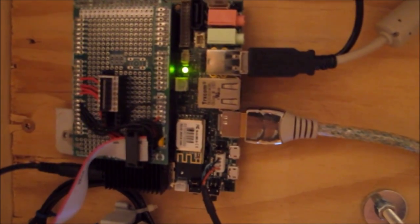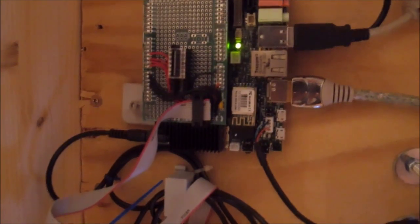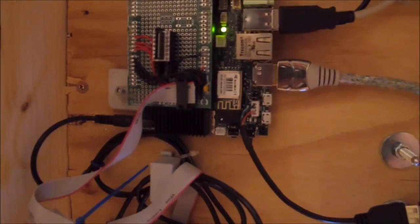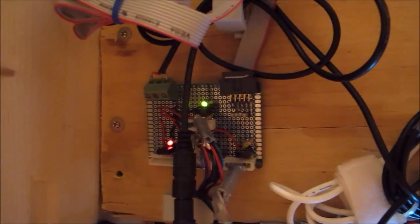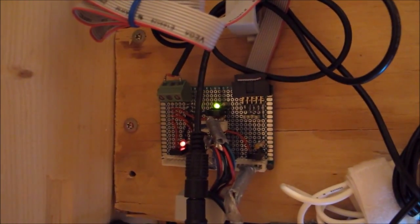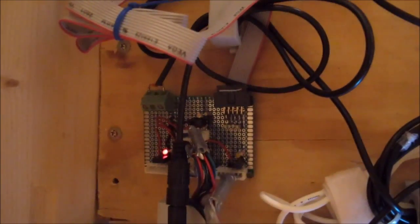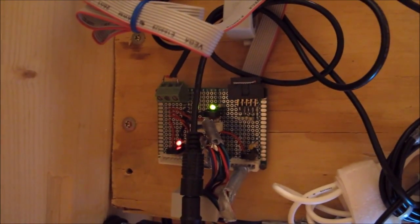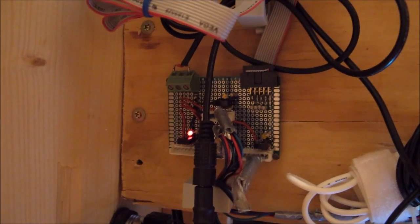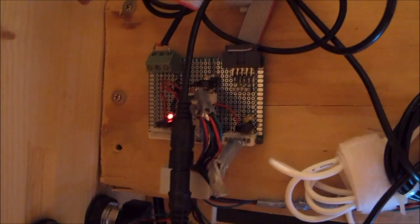You see an HDMI connection to the monitor, and then you see that the prototyping board has a ribbon cable attached to it which just extends to this small prototyping board. This board has a circuit to send power to the LED buttons — basically it gets 3.3V as input and switches this into 12V using simple BD135 transistors.